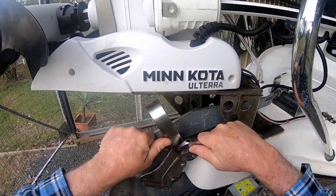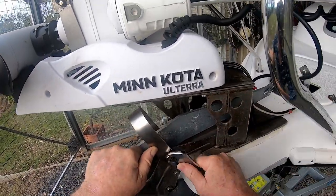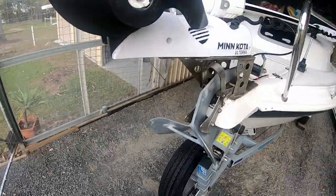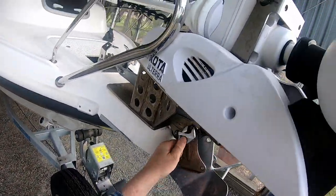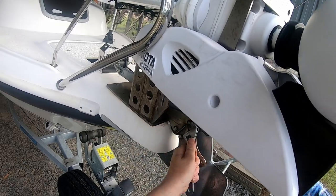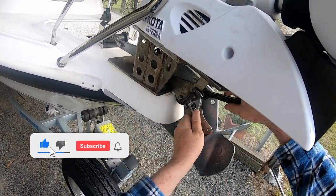The reason I have it at all is that when I first put my anchor winch on, I found that one time I took the anchor up over the nose just slightly too fast and it jumped out of the bowsprit. This stops it doing that. It's a really cheap, simple solution. Don't need to buy a special bowsprit just because you've got an electric winch.